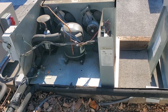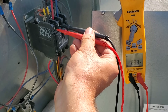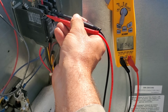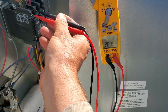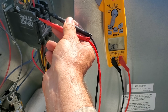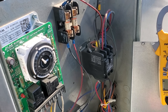We're going to start by checking voltage. We've got the compressor contactor — power coming into the contactor. 208 volts: line 1-2 is 204, line 2-3 is 204, line 1-3 is 203 volts. I say 208 just because it's called 208-volt power, but in actuality I'm measuring 204. So we have three-phase power coming into the contactor.